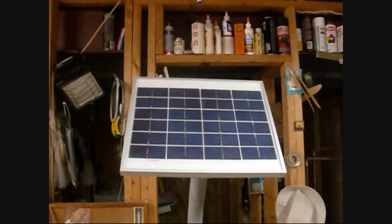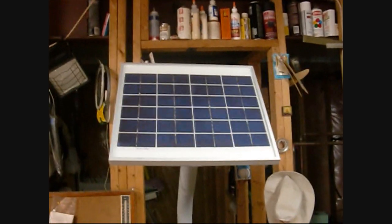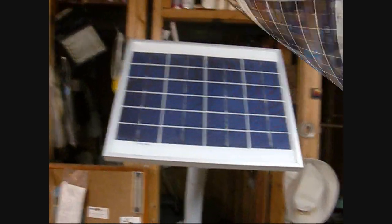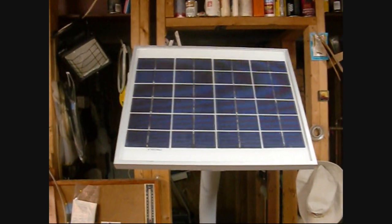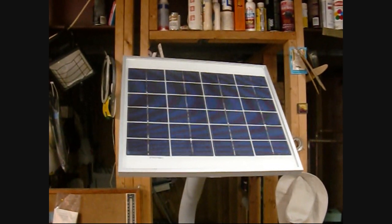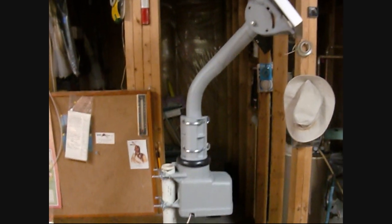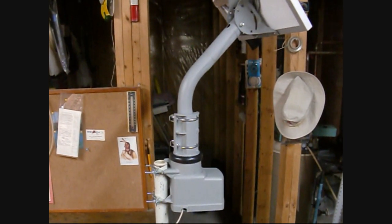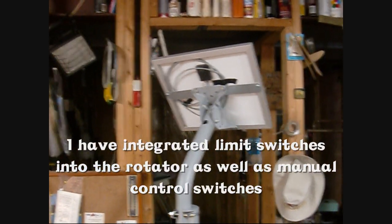So let's imagine here that we're facing south. And now I'll activate my calibration and a simulated solar day. The one nice thing about this rotator, being it's a TV antenna rotator, is it actually has a 360-degree sweep. Like a C-band satellite dish or any kind of linear tracker, they generally can't do even 180 degrees. So this can do a full 360.